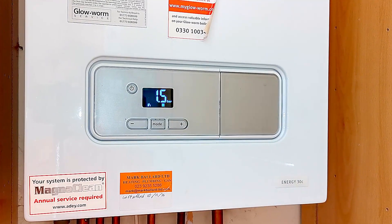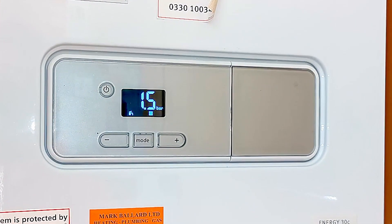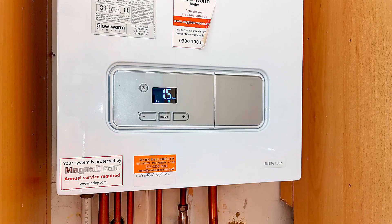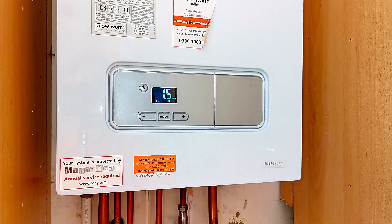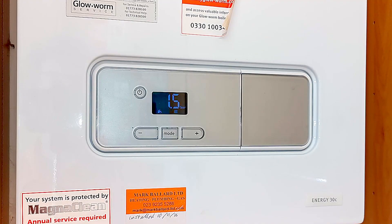If those numbers don't change when the boiler is trying to start up, the F75 fault will just return again. There could be several reasons for this: the pump could be faulty and not running, so the pressure won't change and it will come up with the F75 fault. It could also be that you have no water in your system, so the pressure has dropped enough that it can no longer be pumped around. You may think your pressure gauge says 1.5 bar, but what regularly happens is the pressure sensor — the little device that measures pressure — has become faulty and is no longer reading the correct pressure.